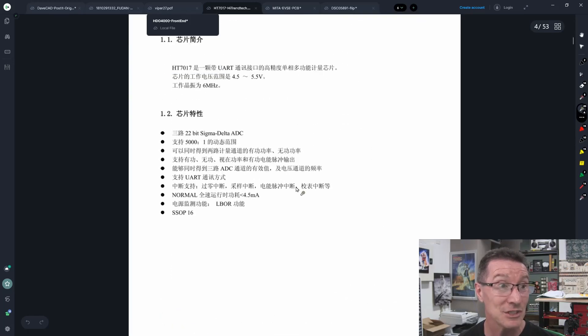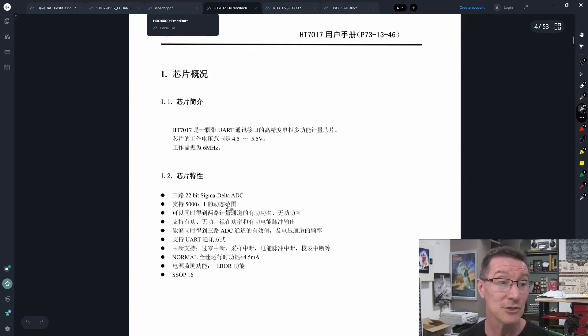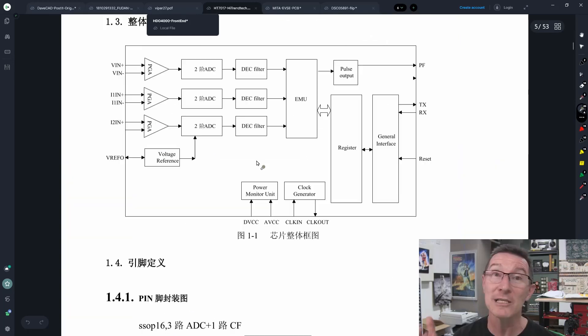Because this is the mains input here, and you'll see it's actually going off through these caps — so you've got a capacitive resistor divider thing happening here. What is this chip? I thought it was near these pins but I got fooled — it's actually this thing. We've got a HiTrend Tech chipset here. What it is, is an energy monitoring chip. I didn't expect an energy monitoring chip — there you go, a 22-bit Sigma Delta ADC. I expected just basic current limiting, there's no need to measure real power and apparent power, but maybe it's just for overload and maybe it's cheap as chips. Ha! I'm here all week.